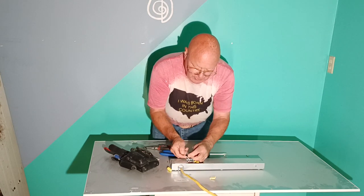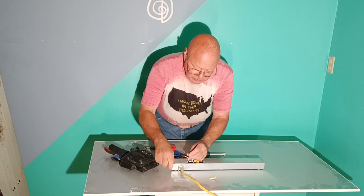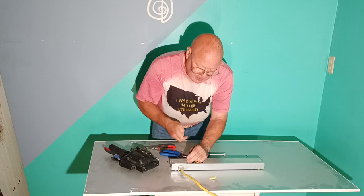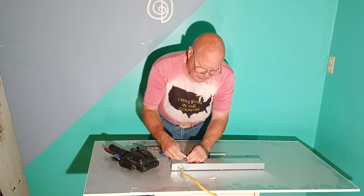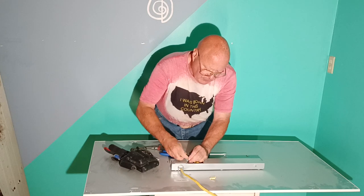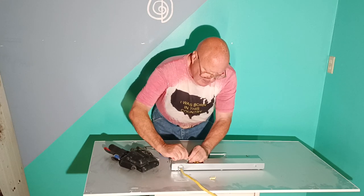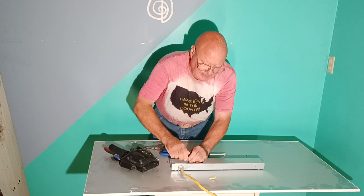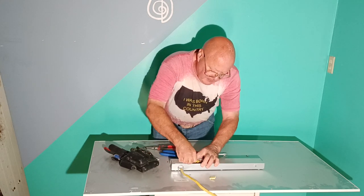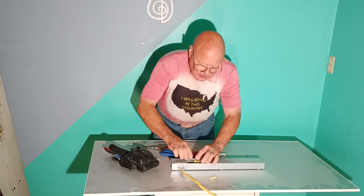And we'll take our white wire. We'll do the same here. We'll get our insulation even at the bottom and our copper even at the top like that there. Take our wire nut. Make sure it grabs everything. And our insulation is going up into the bottom of the wire nut. Okay, we'll fold it down and we'll get it back into a little box down on here.